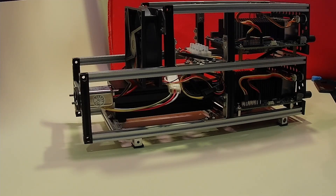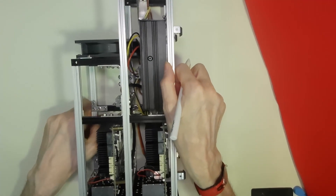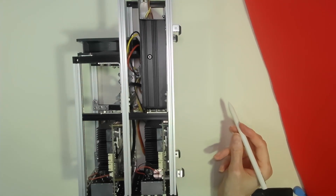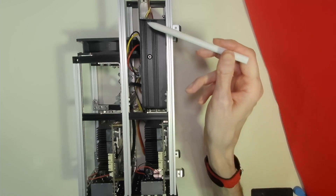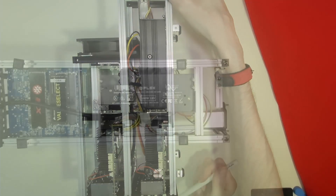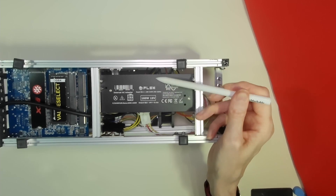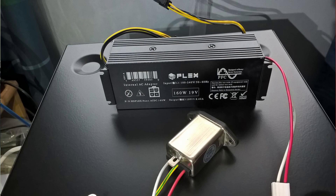In order to achieve this I needed to locate a power supply capable of delivering that kind of voltage and amperage to all four Odroids. As you'll see in the cluster here, the power supply I eventually went for was the HD Plex power supply. This particular one is one of the older HD Plex models I had still in stock, and it is 160 watts.